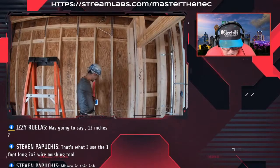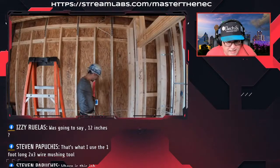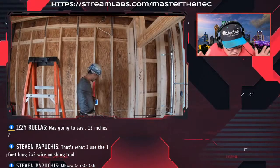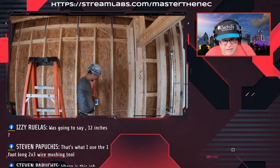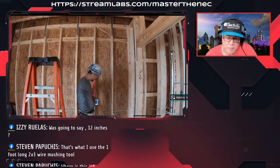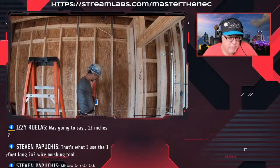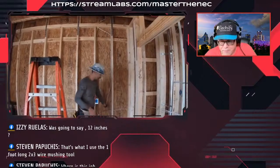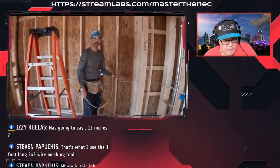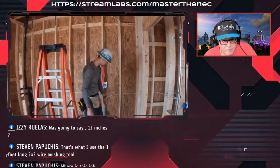But just remember, non-metallic sheathed cable, securing it every 4.5 feet. That's the rule. That's the maximum. Now, he's doing it every 4 feet. That's okay. He's doing it less than 4.5 feet. Perfectly fine, and he's not breaking any rules there. To be honest with you, you could put it every foot if you wanted. But why would you, right? And then within the box, you'll need one within 12 inches also. And again, some inspectors want you to staple within 6 inches of a box.